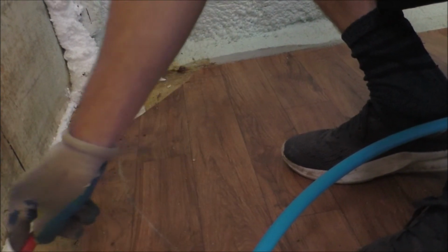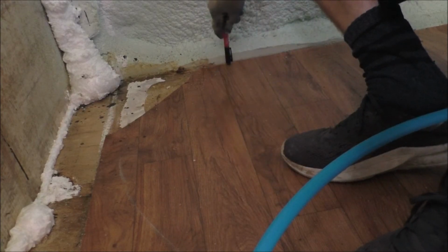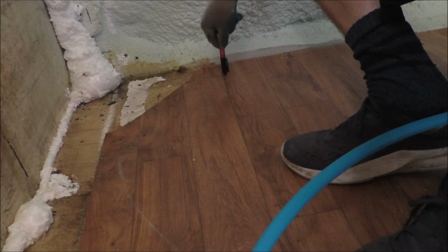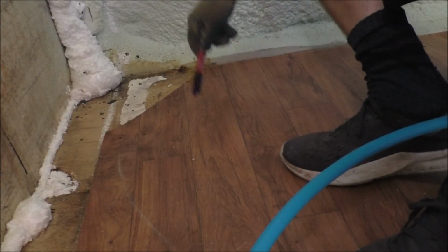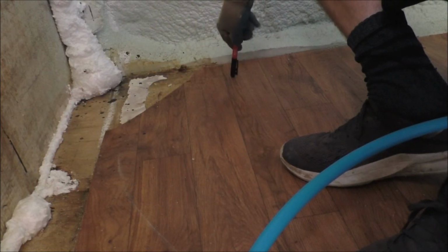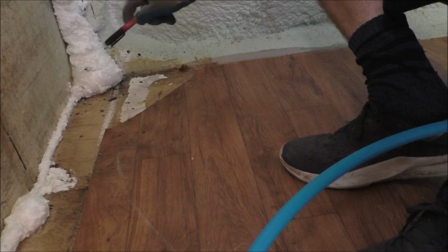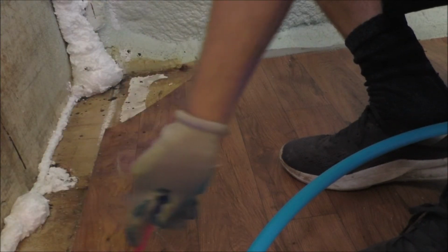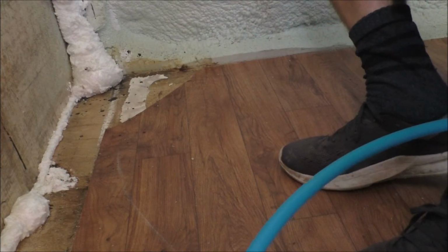But while I'm in this area here, the shower area, I figured after seeing the damage under the IBC totes, what I want to do is mark the floor across here back to at least back here, to bring the subfloor up and to see the damage in here. Because if I'm just not gonna do anything, there's probably gonna be mold still under here, from what I saw from the rest of the deal here.